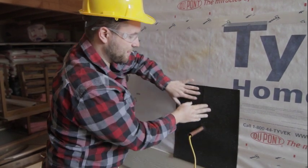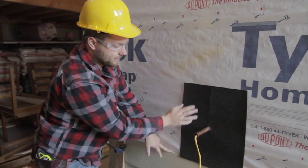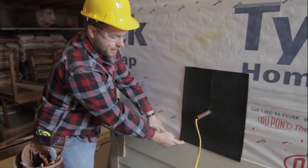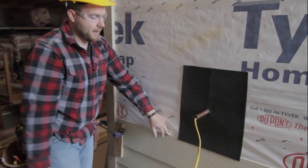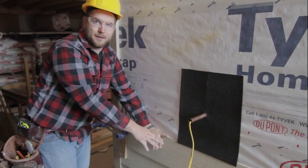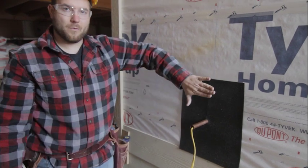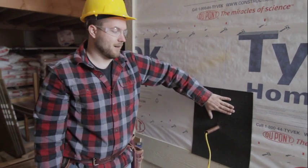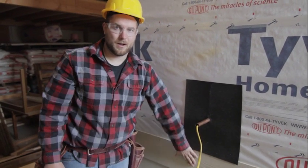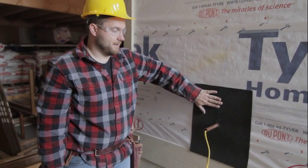It's not going to be perfect, but everything else we put on will really help. The second thing to point out is that this flashing goes over our piece of siding below, and it's important to stay above your overlap. I basically lined it up with our nailing line so that if any water gets behind our siding up here, it'll shed down and go over the piece below, then shed out onto the side of the house. This is that first important step.